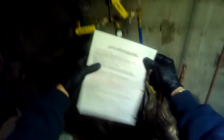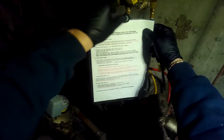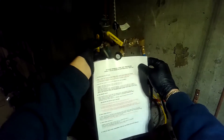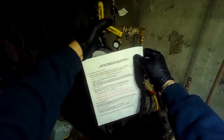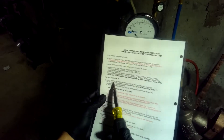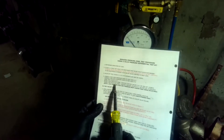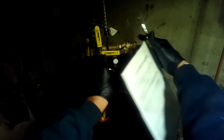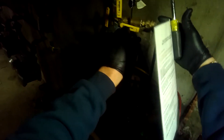Close A - like that. Now bleed the low pressure hose through control valves B and C on the test kit and close B and C. Open B, purging any air through that line, then close B and close C.